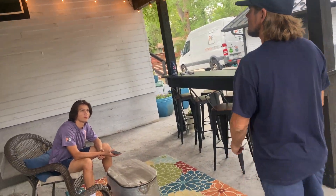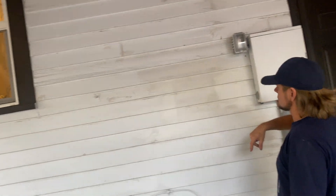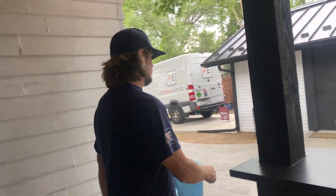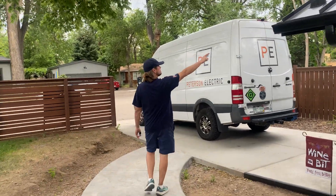There's going to be an AC unit set over there — we pre-wired for that and pushed the wire under the cement. We put a plug up high because they're going to put a big TV right here once they get the house painted. This house is lath and plaster and 110 years old.